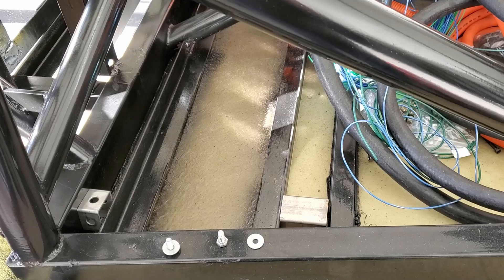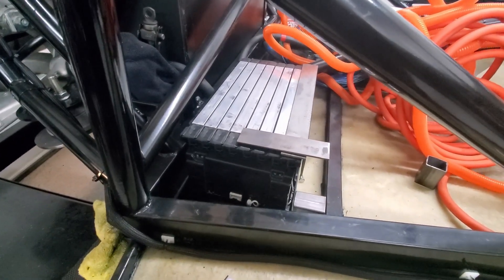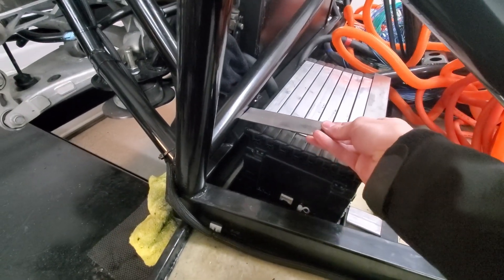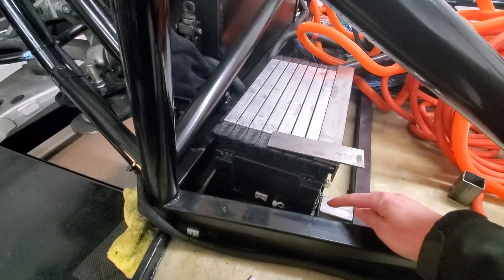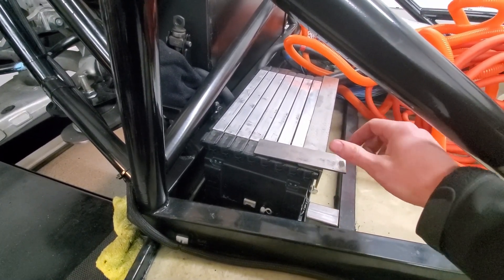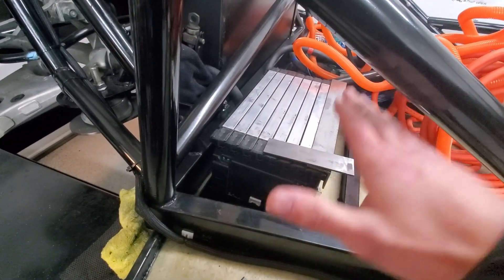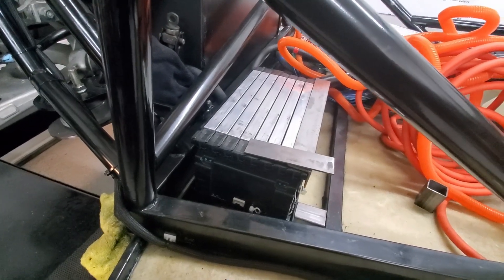This one will take a back seat until I can get the cooling plates. I've been going back and forth, but I think I'll go with angle stock along the side of the battery on both sides, then flat stock across the top with a little overhang. I'll weld those and drill holes for the threaded rod, put a nut on it, and that'll suck it down tight. I may also put little pieces of L-stock on here and here just to keep it from going side to side.